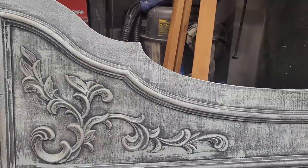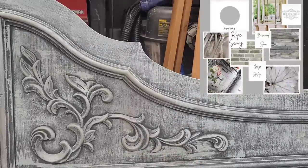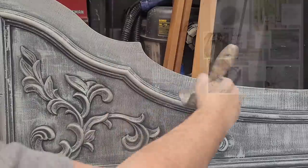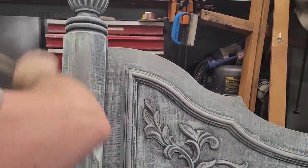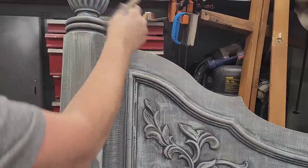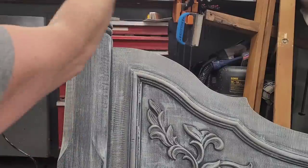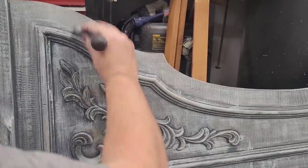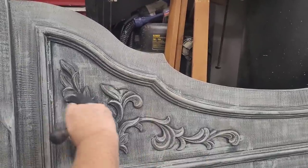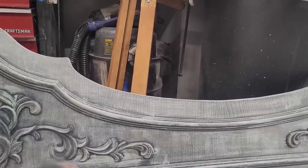For my next layer I'm taking a little bit of my Cozy Home color called Rope Swing, which is a warm soft gray, and it's going to contrast against that soft blue. I'm going to dry brush that layer as my next step. As far as the brush strokes themselves — I fill my brush with very little paint, then go back and refill quite a bit because there's so little paint on it. I lightly brush over the surface, which takes the paint off and leaves those streaky brush strokes I want, then refill with just a tiny bit of paint again.